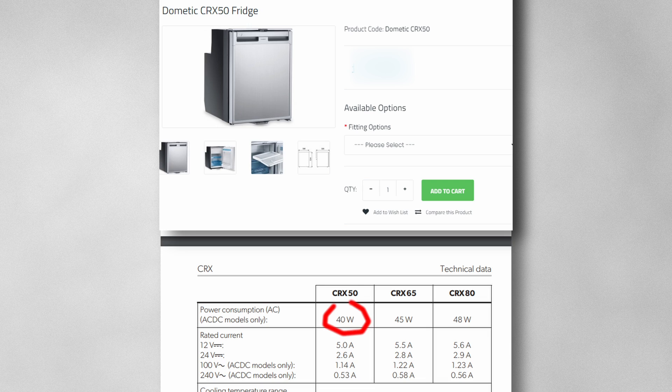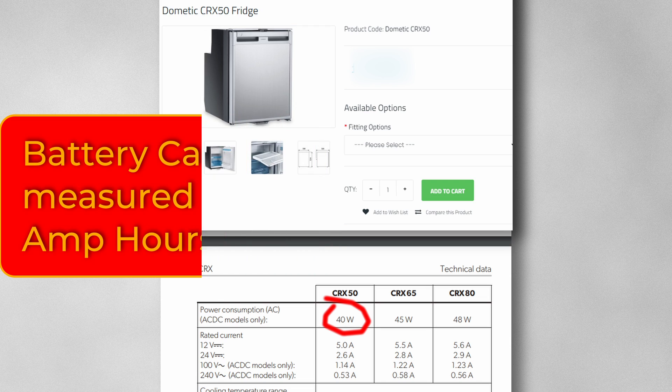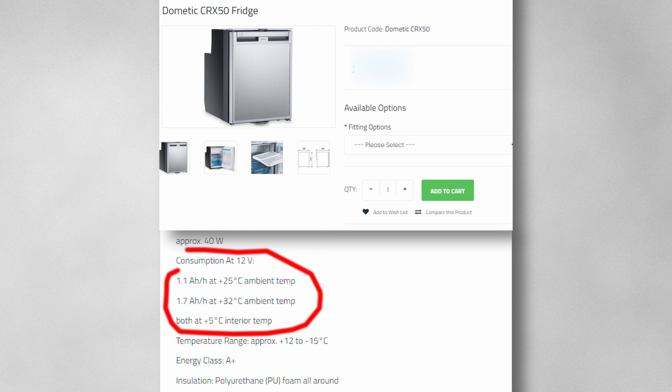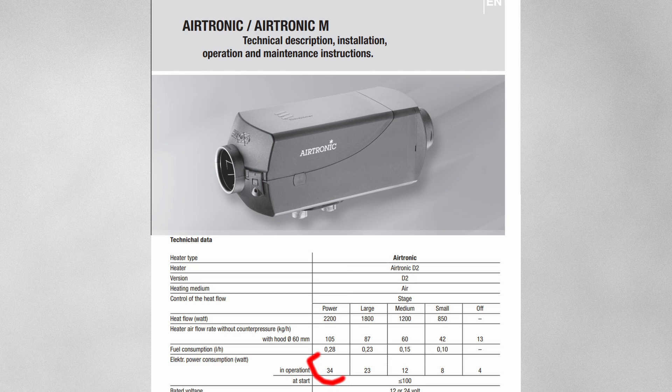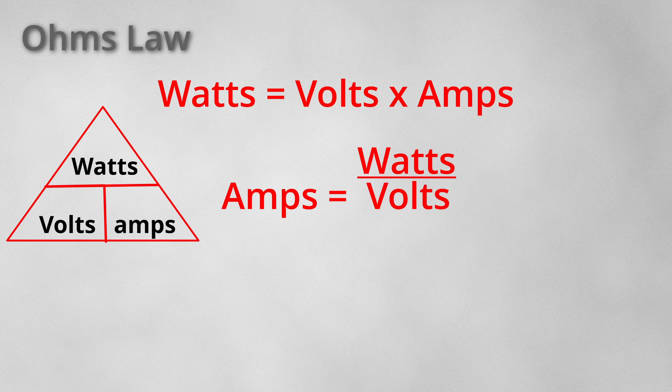Power is measured in watts, however battery capacity is measured in amp hours, so you need to establish how many amps you need over the length of time you intend to spend without charging your batteries. Not every instruction manual will give you a clear figure, but every appliance will say how many watts or amps it uses, and if your system is going to be 12 volts, then it's simple algebra to fill in the gaps. Watts equals volts times amps, or amps equals watts divided by volts — in the case of a battery bank on a small boat, that would be 12 volts.